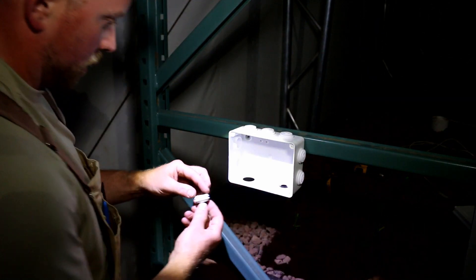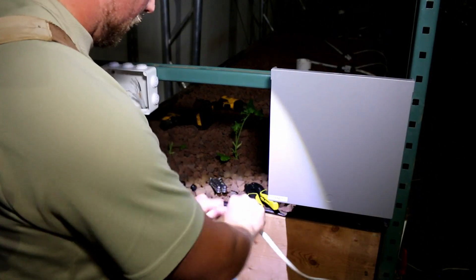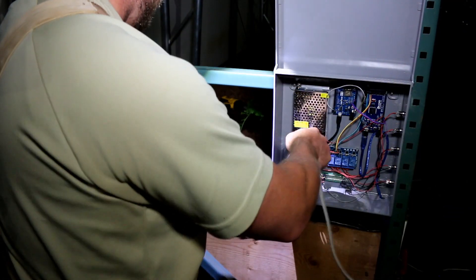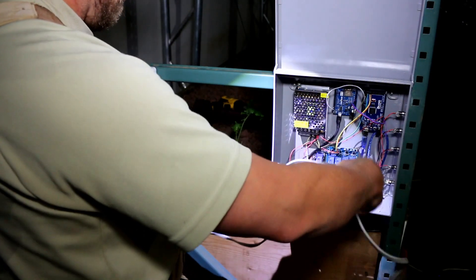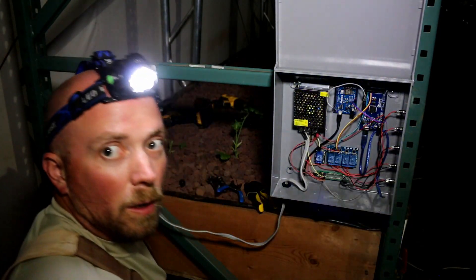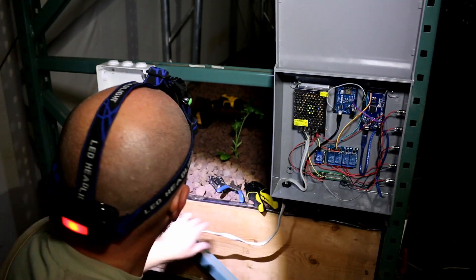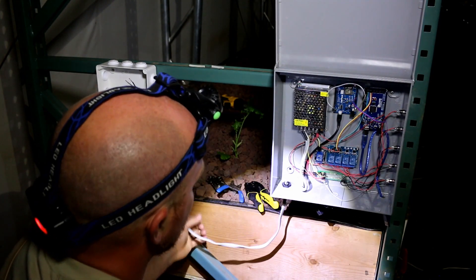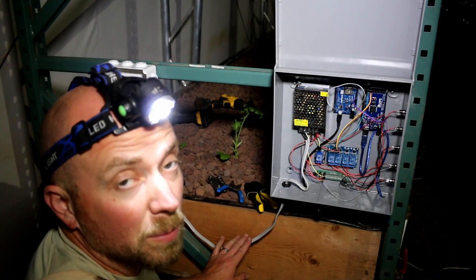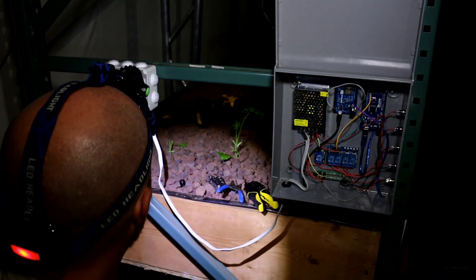To install this you just push it up in there but we can't have the nut on the back side. Bring the wire down here with a little drip loop in it and bring it back up and go through here. So we've got the 12 volt connected here - this is where the AC power is going to be coming in. I've got a little loop in here so if we have any drippage or humidity it can run down and drip off. I also left myself some slack just in case something goes wrong. Now I need to run the AC power line up into here.